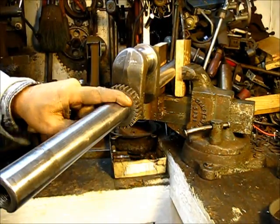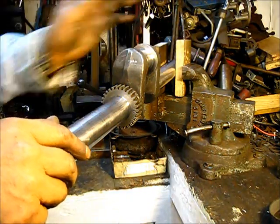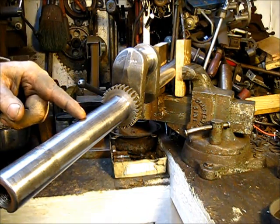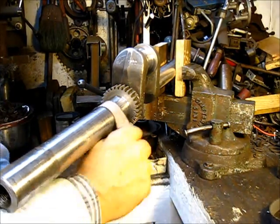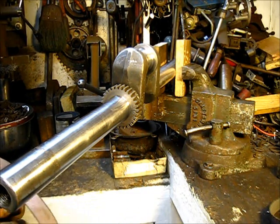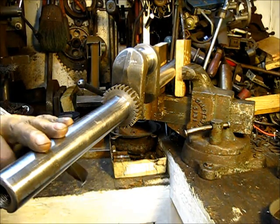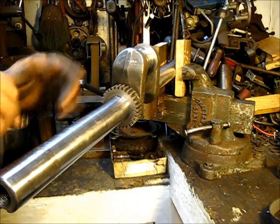And just following up on this, you put the crankshaft in the wood blocks in the vise. After you do the file work, if you got some divots, a divot is okay. You do not want a high place. Any nick or something, you file the high place off and leave the divot. Don't try to file the divot out. The undercut, polish it very lightly. It's easy to take metal off, and it's hard to put metal back on. So the least amount to clean that up, use restraint, stop before going too far.